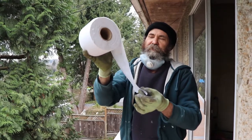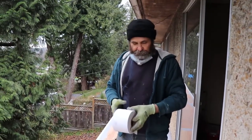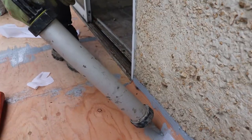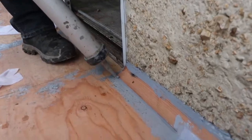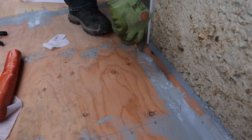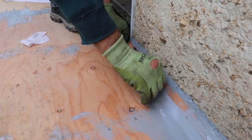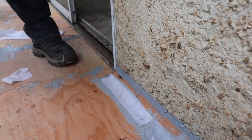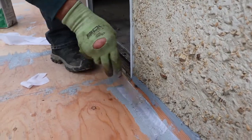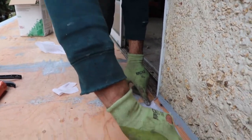This is just a textile tape for the joints. I use a full piece for the joints, and for the corners I just split it in half. I already have a base coat in there, I just put some caulking right there — just a tiny bit. For the corners, I just put it there, make sure it is not too tight but you need to leave a little bit of product in there. Make sure it is tight on the corner.